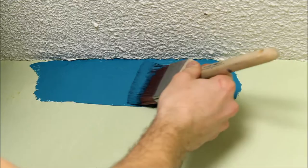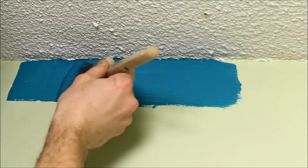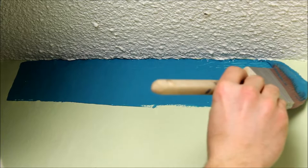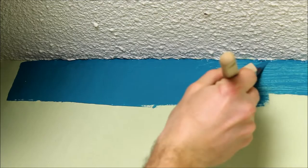Just work slow, take your time. I've gone and taped off a whole room before, taped off the crown molding or the top of the ceiling, but with the popcorn ceiling I really couldn't do that. I've also found that taping takes a lot of time, so I found it a little easier and even faster to just take my time when painting. I'm working on a ladder with a little bucket I poured the paint into, dipping my paintbrush in that bucket and wiping it on the sides so I don't have too much paint on my brush. I'm working slowly with the paintbrush at an angle so that just the tip is barely touching the ceiling to deliver the paint up there and get a nice even coverage on top.